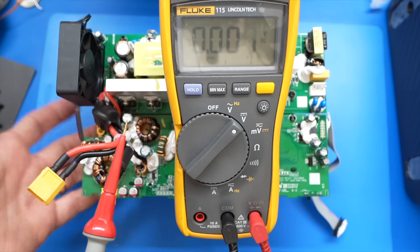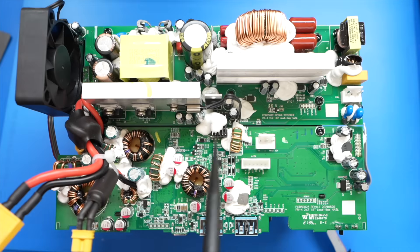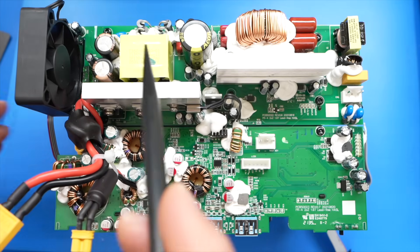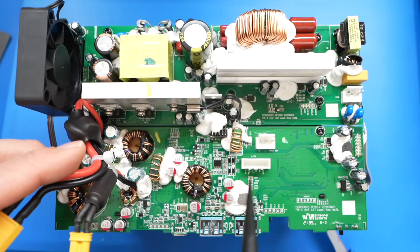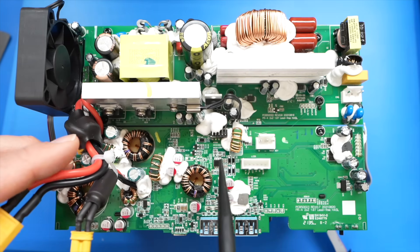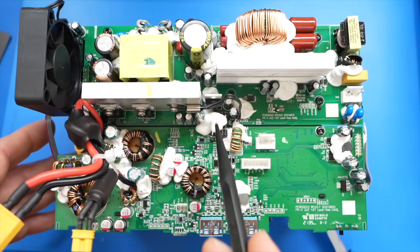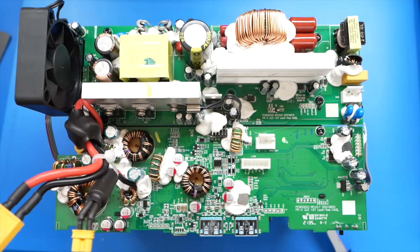This battery pack is a 12 volt battery pack, and we can independently check it — yes, it's coming in at 12 volts. On the top we have two circuit boards. This one up here is the inverter, which takes DC and converts it to AC. This one down here is the brains of the unit and also handles the output and input DC functions. You might be wondering what some of this white material is — it's non-conductive adhesive to hold things in place and guard against vibrations.